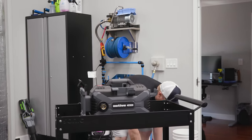This is a glycerin gauge. So there's always an air bubble in a glycerin gauge. If your pressure washer has a gauge and you see a bubble like the Kranzle, your gauge isn't broken, that's how it works. Okay, take my gun, put it in place. You don't need a gauge. I'm going to tell you what the pressure is. You don't even have to trust me. We're going to put it right on the screen so you don't have to think about it.